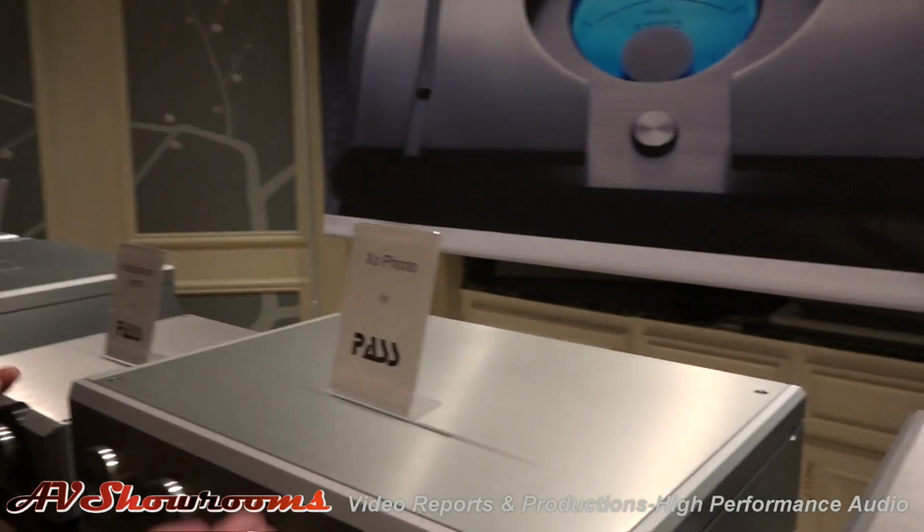We've got some custom caps made in there. We've gone with gold-plated ceramic circuit boards, and eliminated relays in the signal path for switching. To get around that, there are 3 circuit cards for the input rather than having 1 and switching with relays, for low-level signals. We've got great relays that can do that, but no relay's even better. It complicates things and it's a little more expensive, but it is the XS, so that's okay. There's an elastomeric suspension for the circuit boards, so they isolate and float.